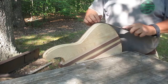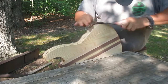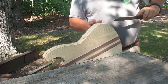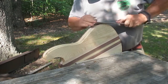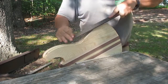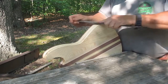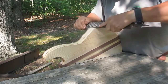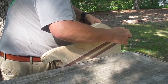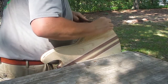You see that black line in the middle on the sides — that's bearing burn, where the bearing got hot and burned the side of the guitar. I could take a sander and sandpaper and probably sand most of this level and flat. But I only have 220 grit sandpaper. I don't have any 60 grit, so what I'm doing is I'm taking a few different rasps and files and just using that to roughly smooth the sides.